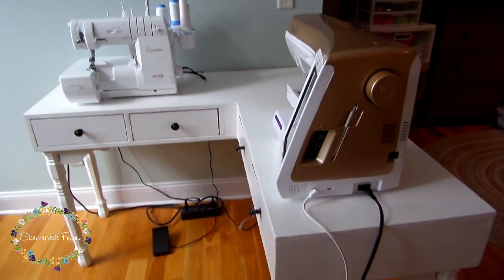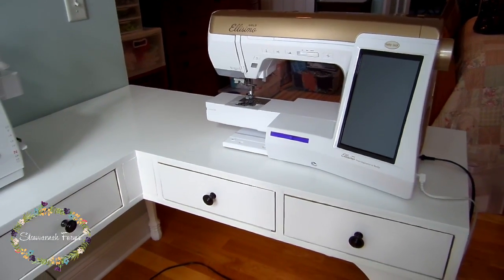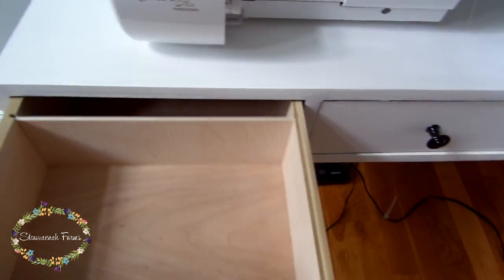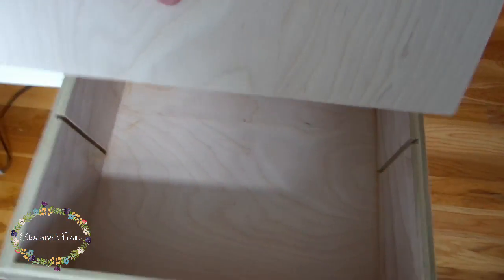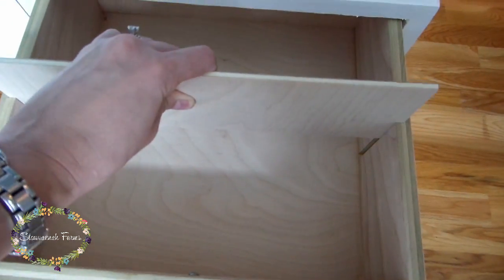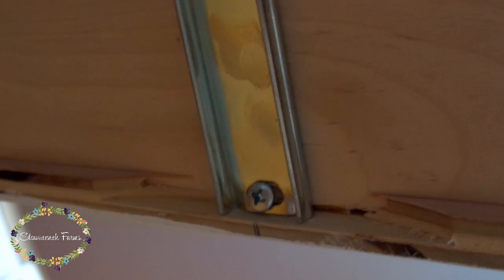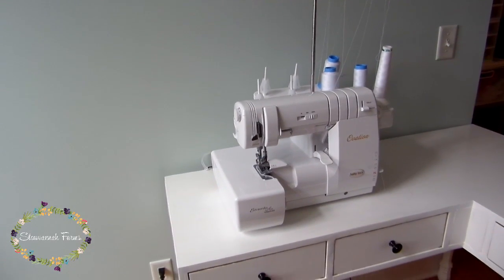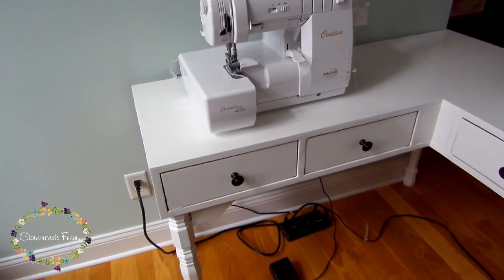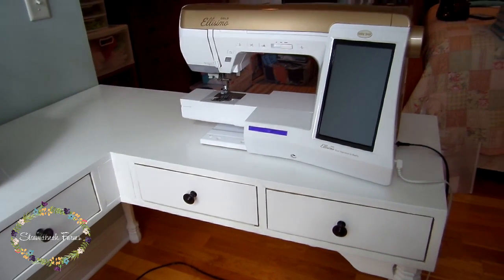Here's the finished desk once everything was painted and the drawers were installed. I'm pretty happy with how it turned out. The drawer dividers were a cool idea, but some of them I ended up dividing too much when paired with slides that weren't fully extendable. I made the dividers removable for customization, thinking she could move them or just move them out of the way to get additional stuff in the drawer. Also, realizing the max drawer length for your drawer slide matters — I made the drawer a quarter-inch smaller than the opening, thinking that would be enough, but it really needed at least a half-inch. That led to some creative use of our dado stack. But all in all, I think it was a great first project and my friend is thrilled with her new setup. I'm glad she has a better spot for her sewing time and her machines.